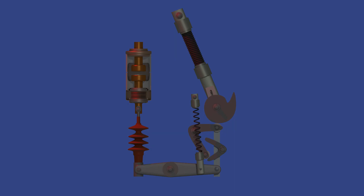This is the cam. It plays a key role in converting the stored energy from the closing spring into rotary motion. As the spring releases its energy, the cam rotates, initiating the closing movement. Attached to the cam is the roller assembly, which helps transfer motion smoothly by reducing friction. As the cam turns, the roller moves along its surface and drives the mechanism forward.